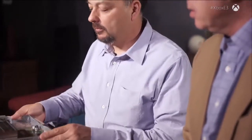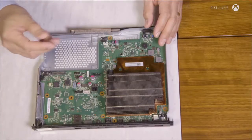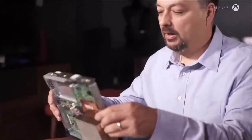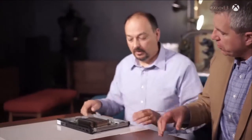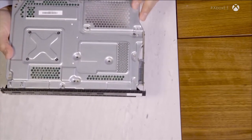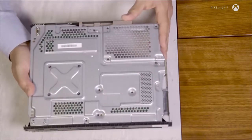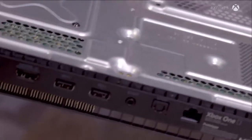So let's start building up the chassis. We use a two-piece steel chassis. Here's the motherboard we just saw with the heat sink added to it, and this metal pan is half of the metal chassis. We use a fairly traditional approach that we started a few designs back — these are drawn out of solid sheets of steel. It's a one-piece drawn design with no seams. This entire tray is one piece of metal, formed in a series of punches so that we have a piece with very precise edges for sealing and no seams.